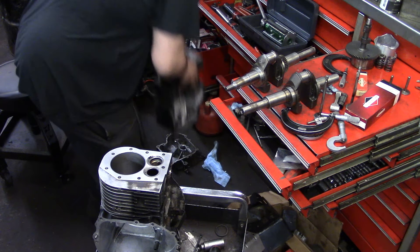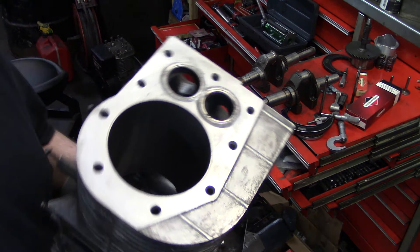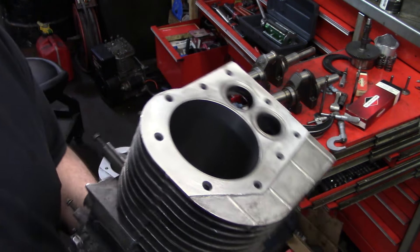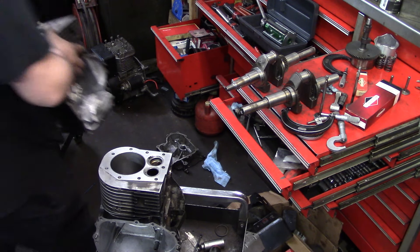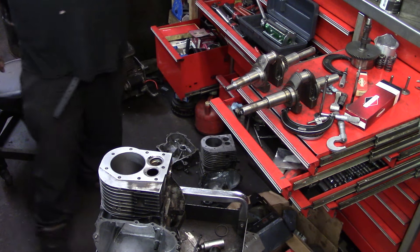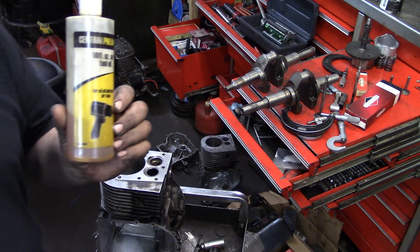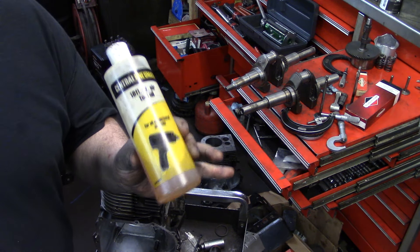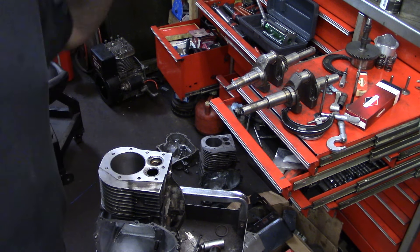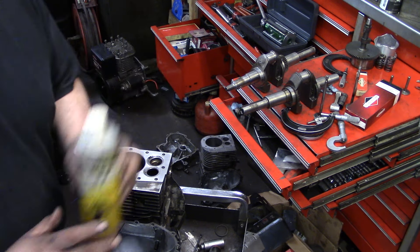Here's the 20-thou motor. The 20-thou is a little dirty — I got to clean this up a little bit. Here's the 20-thou motor. Yeah, when you're done you clean these motors out real good. And one of the things I find for cleaning that honing grit off is this stuff here — wipe that on there, no oil. Get a rag and just go. That honing grit will come right off with this stuff. Really nice oil.